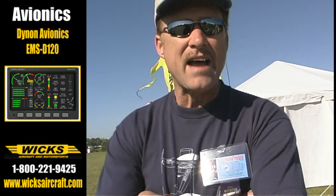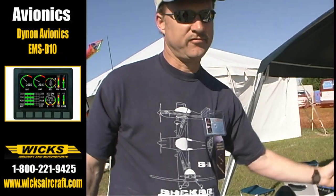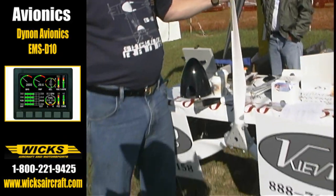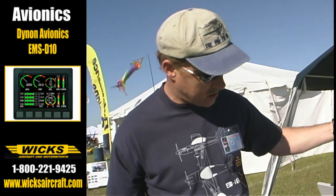Do you want two blades, three blades? No two blades — it comes in three-blade, five-blade, and six-blade. We haven't had any demand for the six-blade; mostly three-blade is what we sell the most of. Weight-wise, very light — well within the mass-moment inertia. This 67.3-inch diameter prop weighs less than nine pounds.